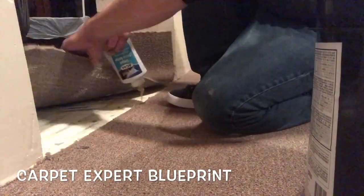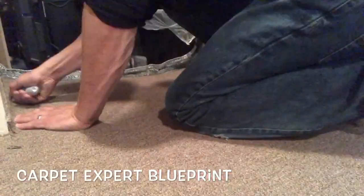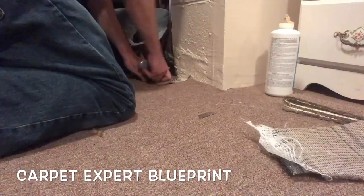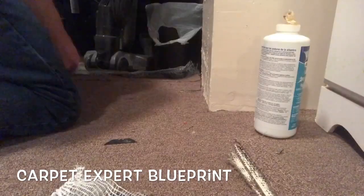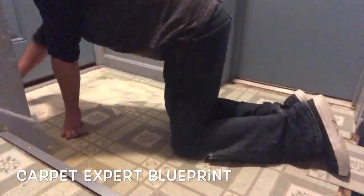You can see I actually did a double cut on that and we are going to seal the seam. Going to go ahead and slide it together to make sure none of the fuzzies run, and we're going to trim it in with a razor sharp knife. Be sure to change your blades several times when you're working with indoor-outdoor carpet because it frays and runs. You want a good sharp blade when you're trimming it.